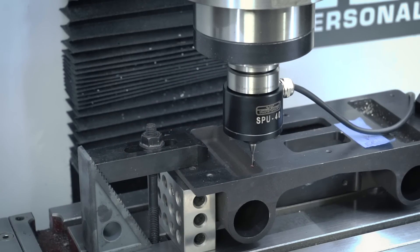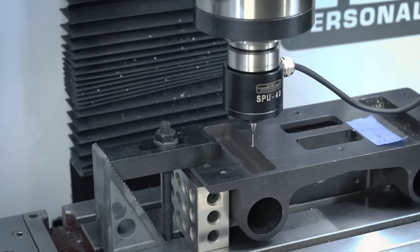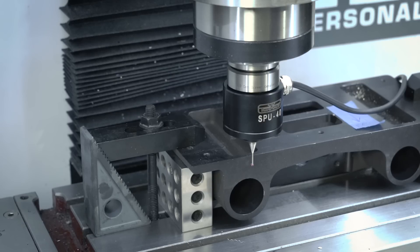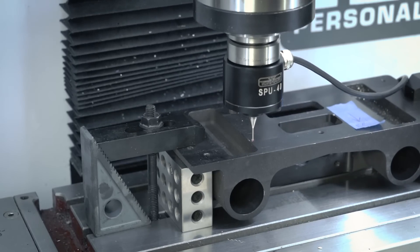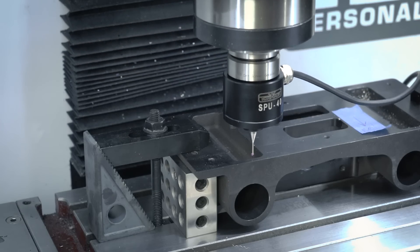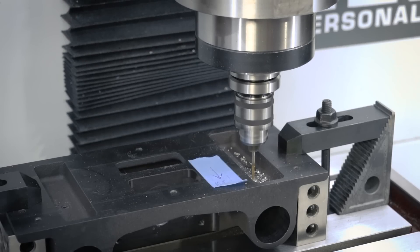I used the passive probe on the mill to ultimately find the hole locations. There's a channel that runs on the same plane as the bore for the bearings, so I used the probe to find the center line of that — that's where all the holes would go. Once I found that, I would indicate off the front face using calculations from my notebook to give me the hole locations, then reprobe on the back to find the locations on the back.